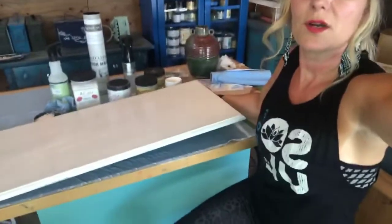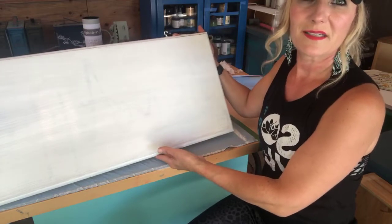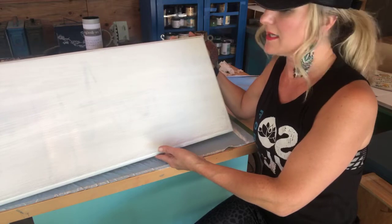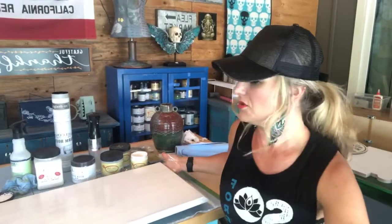You can see one coat — you can kind of see through a little bit. As for how often to mist the brush: pretty much continuously while you're painting. As soon as you dip your brush in, spritz it and put it on. You'll get to know how to do it. You can even add a little water to your paint. These misting spray bottles are a super game changer — once you use one it's going to be like, I need this. It will make your finish look a lot better.